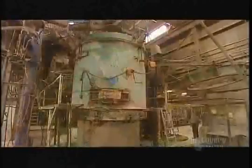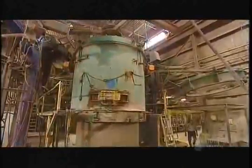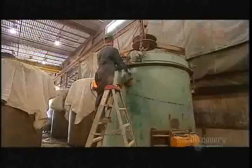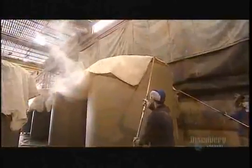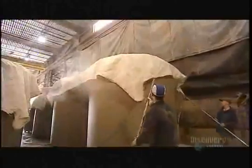With either pipe forming technique, the molded concrete is quite fragile, so the molds go off to the curing warehouse to harden. There, workers remove them, leaving the pipe standing upright. Steam hoses transform the curing warehouse into a sauna. The temperature rises to 60 degrees Celsius, the relative humidity 100%. The concrete hardens in about 12 hours.